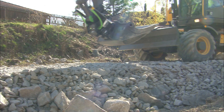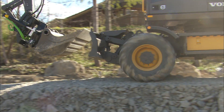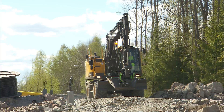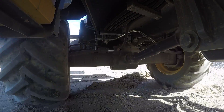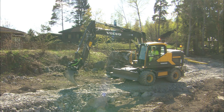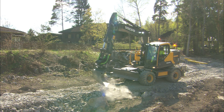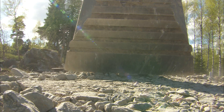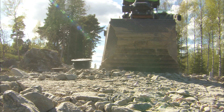When traveling off-road, make sure the front axle is unlocked and the bucket is as close as possible to the front axle. The front axle is an oscillating axle, which can absorb obstacles and uneven ground, providing much better stability. Be familiar with the machine dimensions and the ground material. Try to avoid extremely uneven or rough ground. If necessary, when about to use the track several times, consider using your bucket to prepare the ground for better and safer driving.